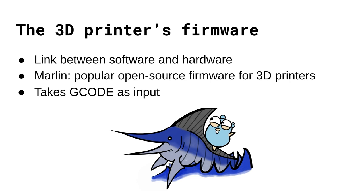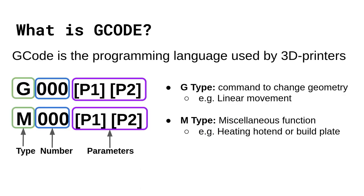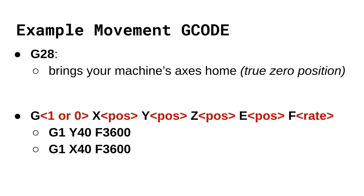You can communicate with this firmware using a programming language known as G-code. The syntax is broken down into a type-and-number format, where a type and number are associated together and related to a task so your firmware knows what command and instruction is being sent. The types possible are the G-type, related to a geometry category of instructions based on linear movement, and the M-type, related to miscellaneous function categories. The number identifies the specific command, and they can also accept some parameters.